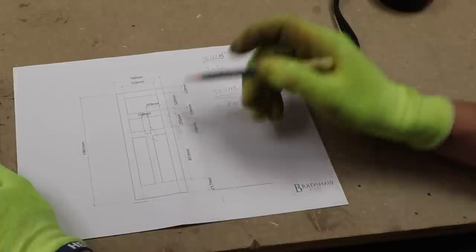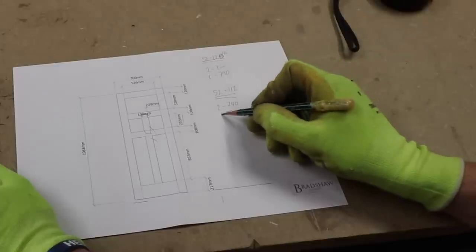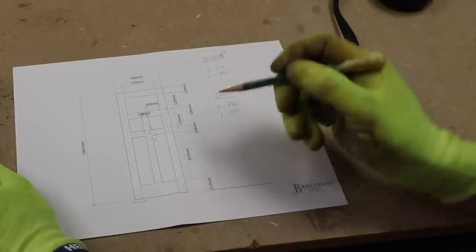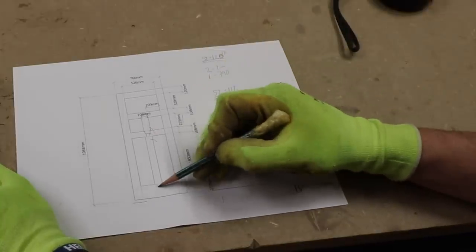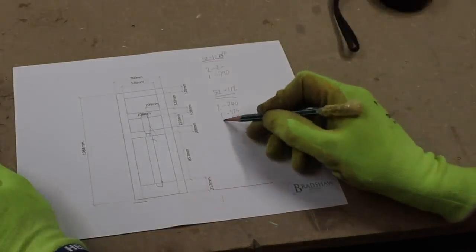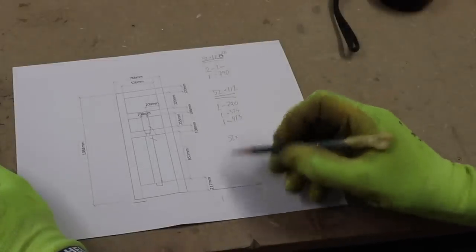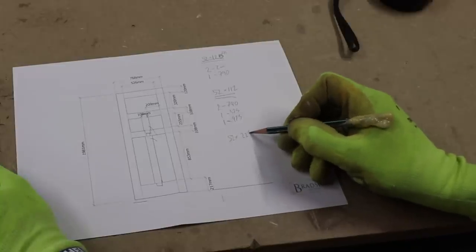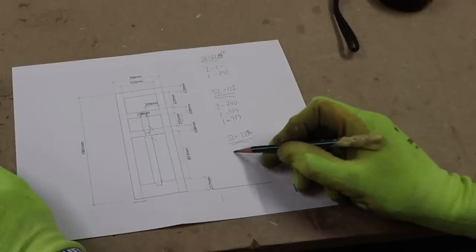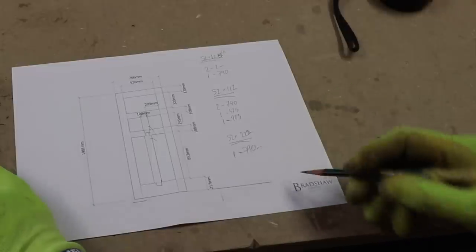We're going to add 120 mil onto that 255. That leaves us with 375. The one at 375, and we've got 853, so again, add that 60 mil tenon on to each end of that. So we're going to add 973. Then finally, bottom rail, want a piece 52 by 223 to get that 217 out, 222. And then we want one of them, and that's going to be 790 millimeters. So that's our cutting list.